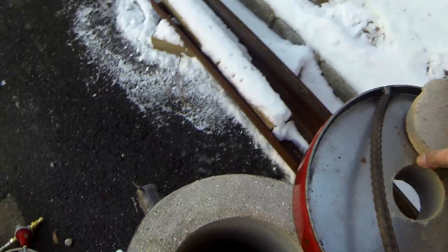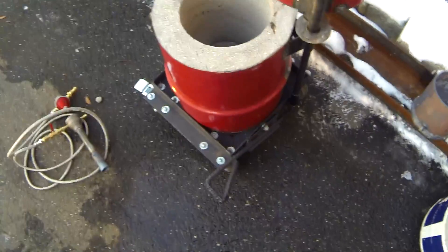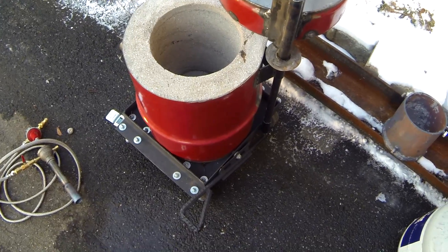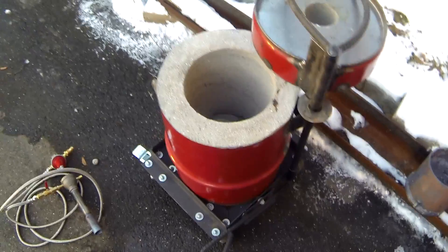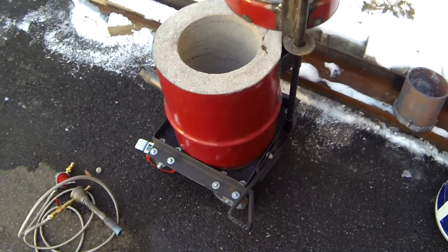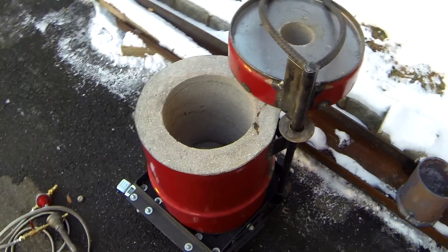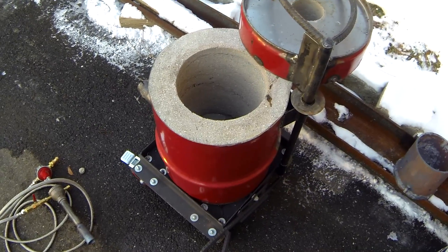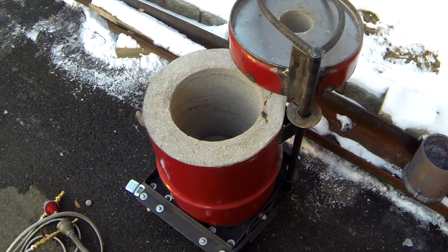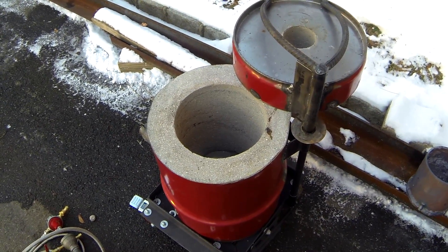Don't forget you have to dry out your cement — whether you use refractory cement, bentonite clay, ground-up cat litter mixed with plaster of Paris, or other types of refractory cement. Whatever you decide to use, run the burner slow in the beginning. I let it dry for about 48 hours, then ran it for about half an hour on the lowest setting my propane burner can push out, and let it cool down naturally.